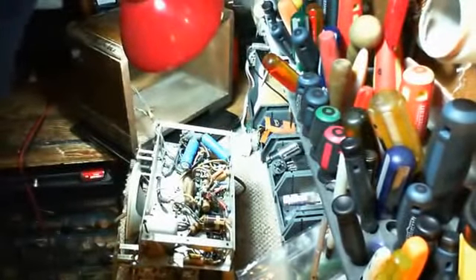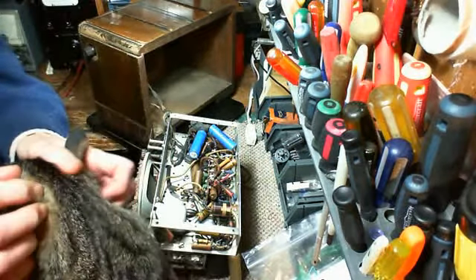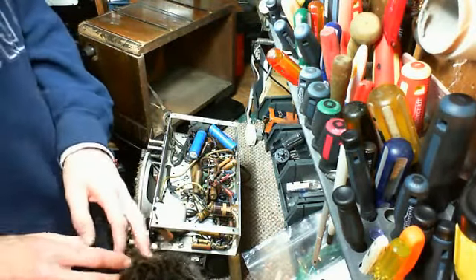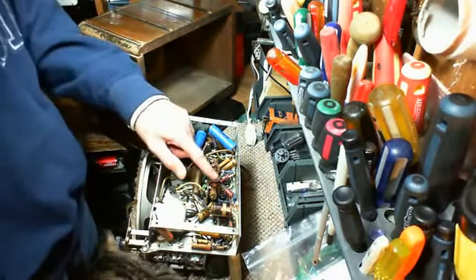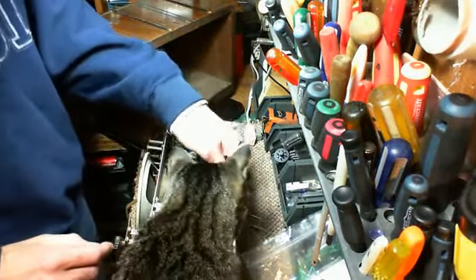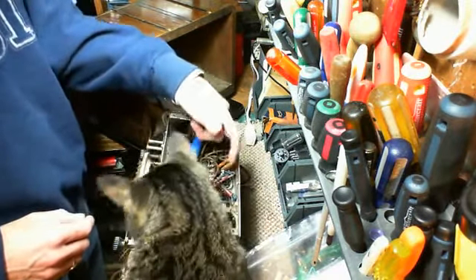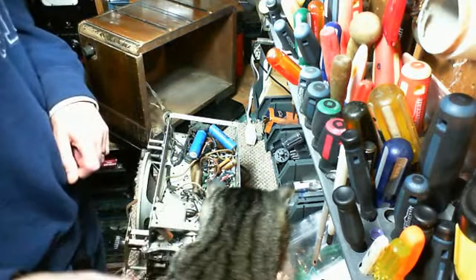We're ready to start some work on this radio after examining it yesterday and noticing a few important problems — and there's probably some invisible stuff in here too. An important problem is this resistor here is burned out. This odd connection to this wire. The insulation on these blue wires here is shot. I'm showing Draper exactly where the problem is. Get some cutters and get busy here.